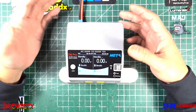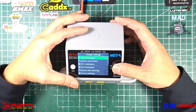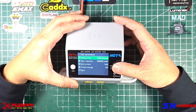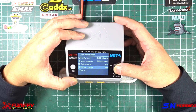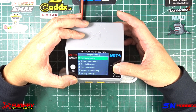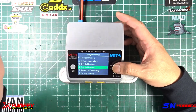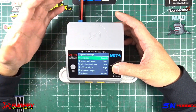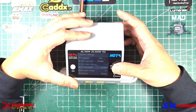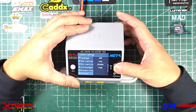That's it for changing channel settings. If you want to go to the system setting, you do a long press and it takes you to this window, which is the charger settings. Task parameters — I won't go through that, it's pretty self-explanatory. The trickle charge I turned off because I think that's for lithium ion packs. Calibration I didn't go through because it's a very cumbersome process where you have to put in codes. System parameters: minimum input voltage, backlight — I changed this to medium but it doesn't look good on video, so I kept it at high. The wireless charge is turned on. Volume I might turn to middle because high is too loud.